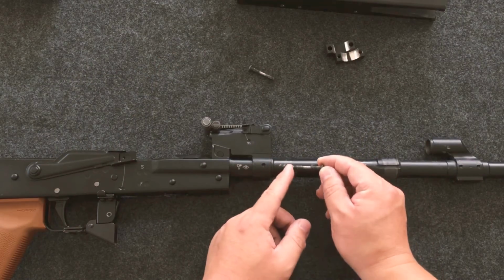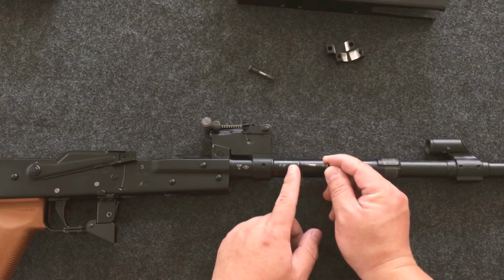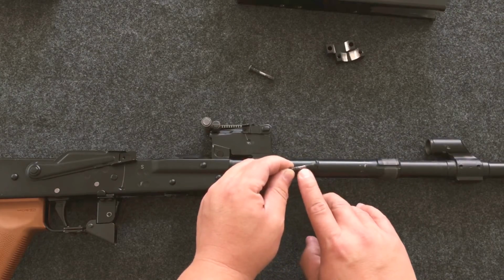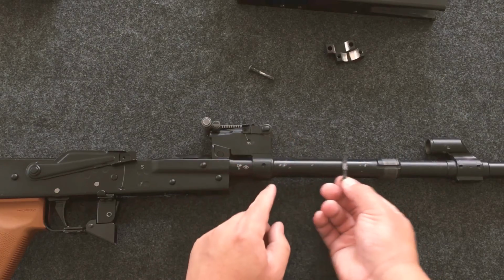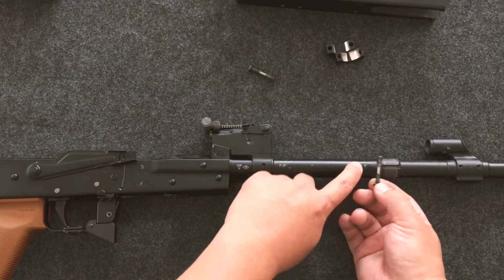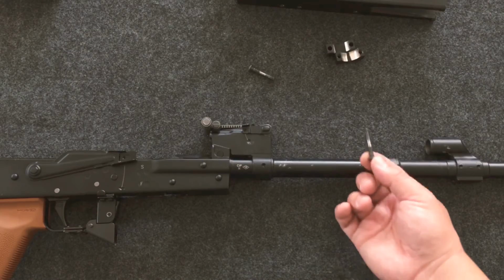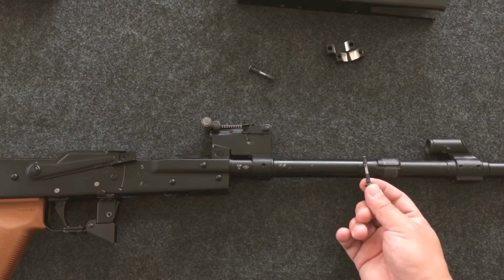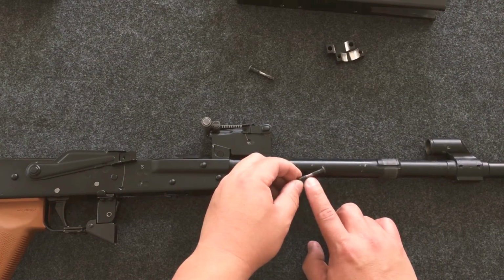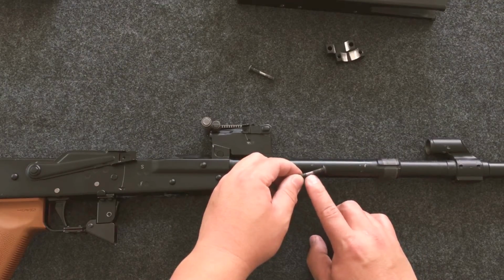Also, the fasteners need to be modified. These are about 1/4 inch longer, 1.25 inches. And the middle section has threads that have been removed, because the middle section touches against the barrel, and if I don't remove the threads there, the threads will actually start chewing into the barrel because they're just that close, since this was never designed for a barrel of this big a diameter. I got that idea off of AKFiles. A lot of guys had done this before and said, hey, just take out the threads in the middle and you won't get as much interference.